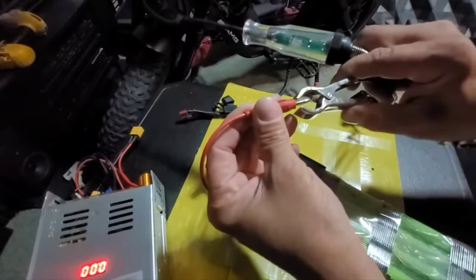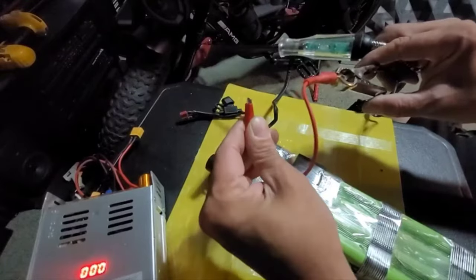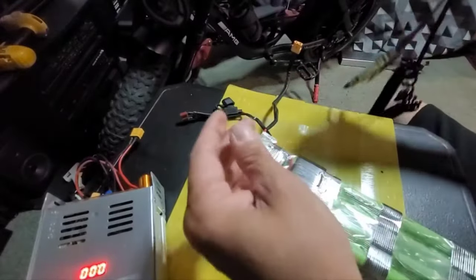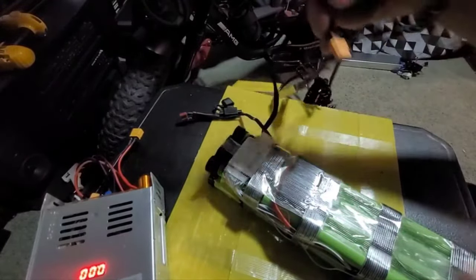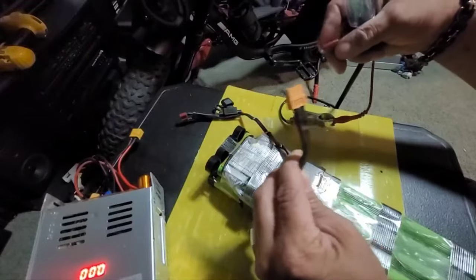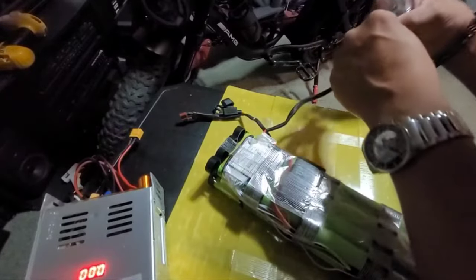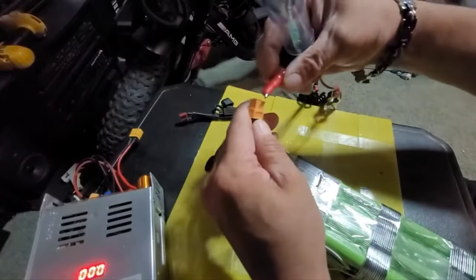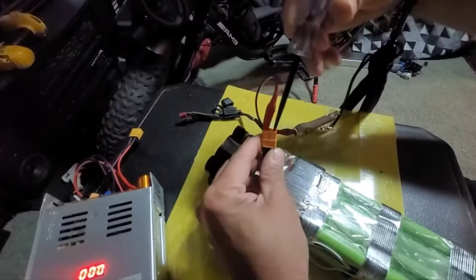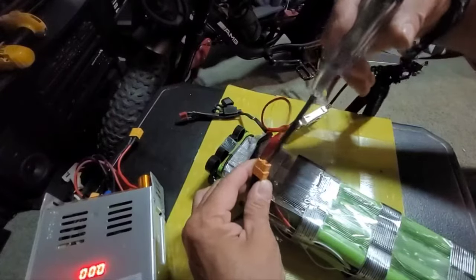What I'm going to do is clip it to this small wire that I have with a little alligator clip on it, because this alligator clip is way too big to clip onto parts of this battery. Initially I just wanted to test this battery — the guy said it's not getting any voltage and he tested it with a test light. I'm going to do the same thing: put my alligator clip on ground and stick my probe there. As you can see, no light, no power.